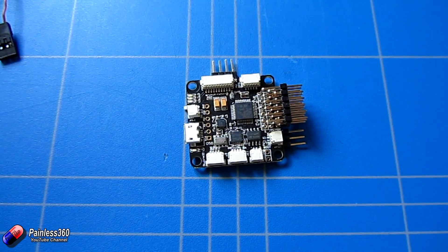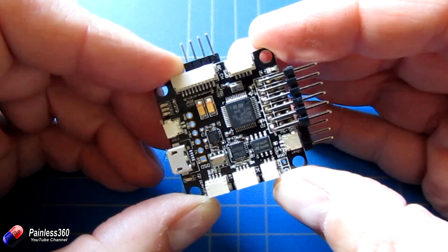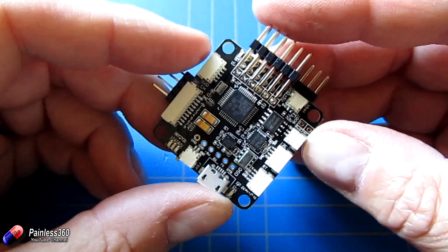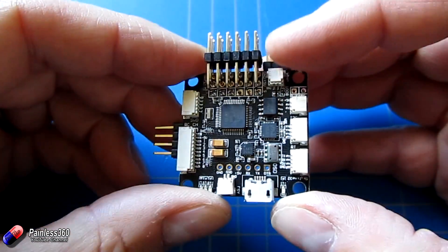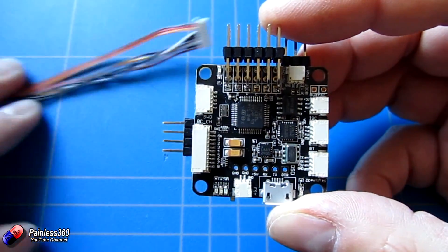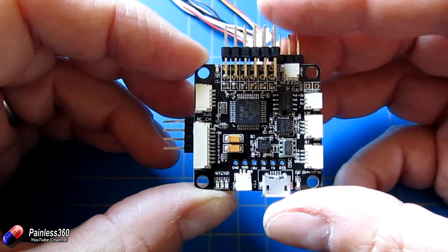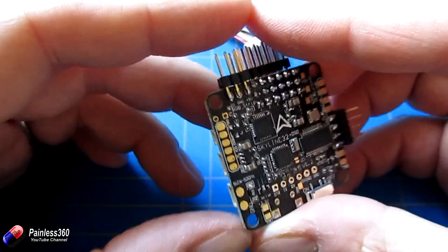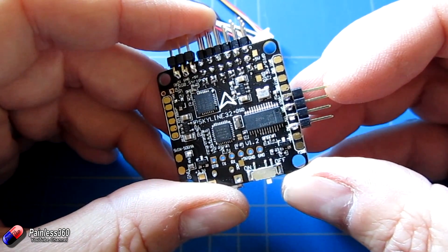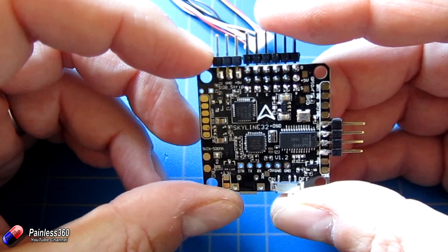We just spent a happy five minutes soldering, so here's the board configured with the pins all attached. We have the board with the front facing forward and USB at the back. It comes with right-angle and flat pins — that's where the motors plug in. We have the cable with all the different ends for the receiver. Underneath I've put pins on for the video ins and video outs with ground for the FPV rig, and also three pins on the LED strip pads because we tend to use that on all our craft — it's quite a cute feature of CleanFlight.